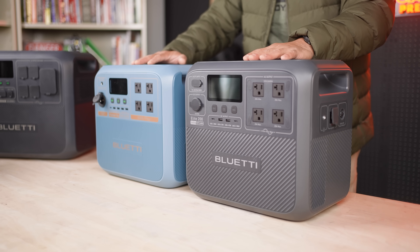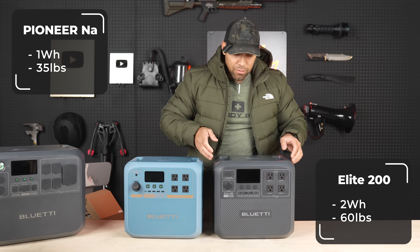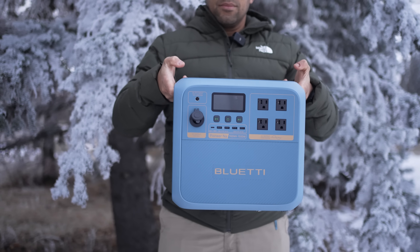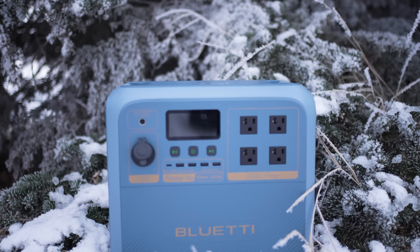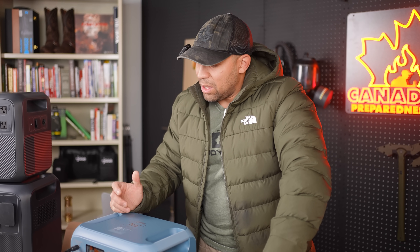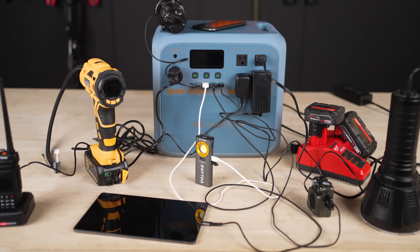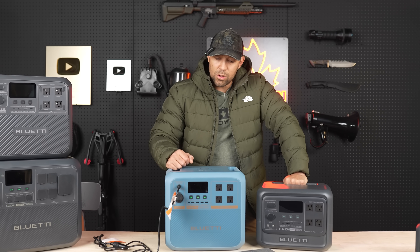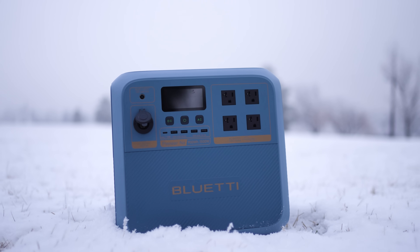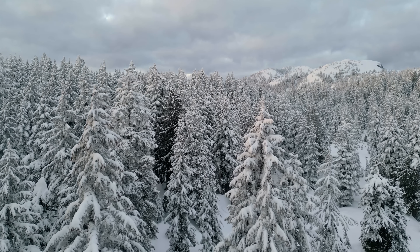So here we have a good comparison. Basically one kilowatt hour, two kilowatt hours. This is 35 pounds. I would venture to say this is probably closer to about 60 pounds. So it's much heavier. So I guess the question is, if I had to go on a camping trip, would I realistically use this in the wintertime over this? This is kind of the icing on the cake because the ability to just charge your phone by putting it on top — that's pretty cool, or your tablet or whatever. I think you're getting more conversion loss with the wireless charging. So it's less efficient. If you were to charge it by USB-C, you'd be transferring the power to your phone more efficiently and not having as much conversion loss. But in the Canadian North in the wintertime, I would probably go with this.